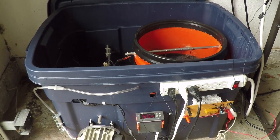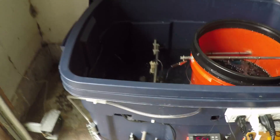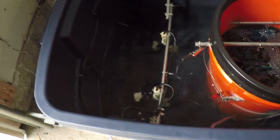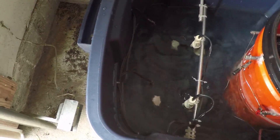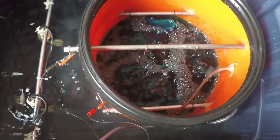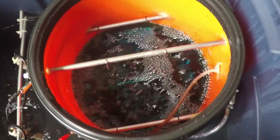So I want to go over basically how I built it. It uses a basic two-tank design. There's a heating tank with two heating elements and two submerged pumps to circulate the water. And then there's the actual plating bath that sits in the heated bath. That allows me to have a heated bath without getting any heating element into the electrolyte, because the electrolyte is a very strong acid.